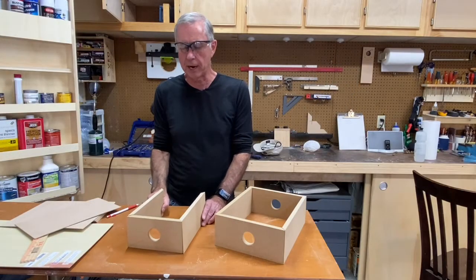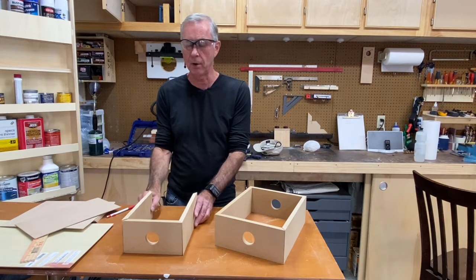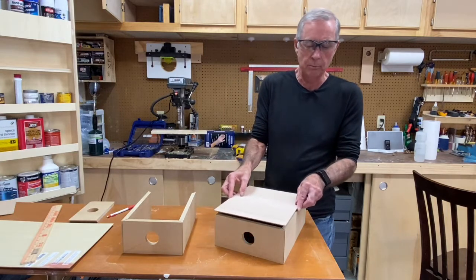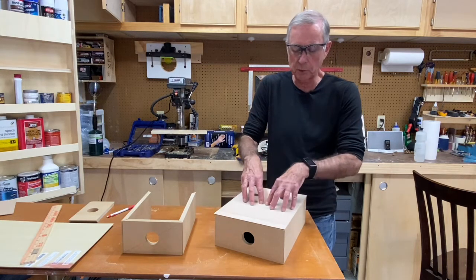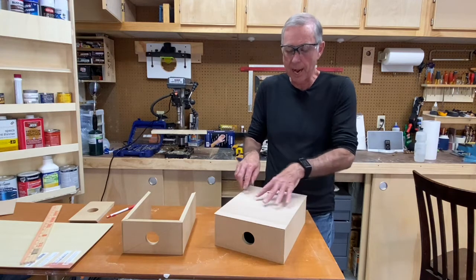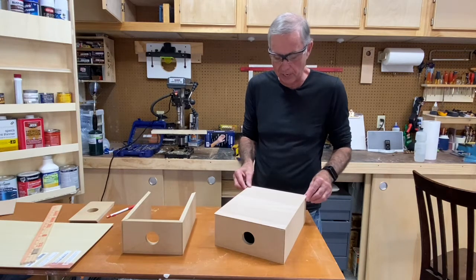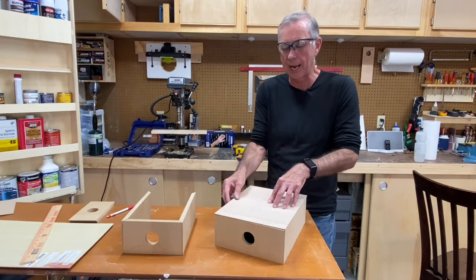We have our shapes cut out here for our mini cajon drum and our ultra-mini cajon drum. Even though I made this too small I'm going to go ahead and finish it and I'll just give it to my granddaughter. The next step is to put a top and a bottom onto our cajon, and like I said I've got this eighth-inch plywood. This particular cajon was nine by twelve so I cut this piece nine-and-a-quarter by twelve-and-a-quarter, so I've got a little lip that hangs out all the way around. I have a trim router that I can come back and clean this up. You could very easily cut it to be more exact if you don't have a trim router and then just sand down the edges so they'd be even. But since I've got a trim router I've got a little more room to get it exactly fit the way I want it.